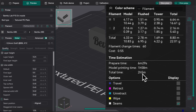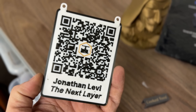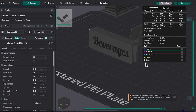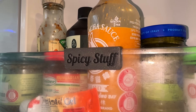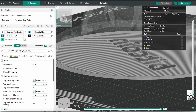The former is sometimes passable, especially if you use the right build plate and nozzle size, and can even offer a wide range of options such as colors that you just can't get with other options. But to quickly reiterate the downsides: doing this adds time, material cost, and complexity, and sometimes doesn't come out on a smooth build plate. It requires a 0.4mm nozzle or smaller most of the time, and really works best with a wasteful multi-material system or a very expensive tool changer. Those problems are compounded if you need the text on the body of the print — just look at how much time and material are wasted with purge, and even still, the end product has seams wherever those colors meet.